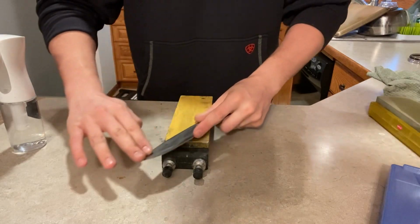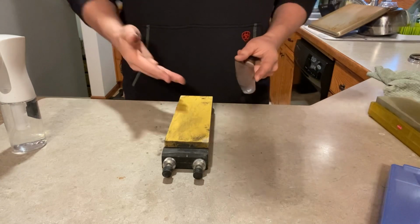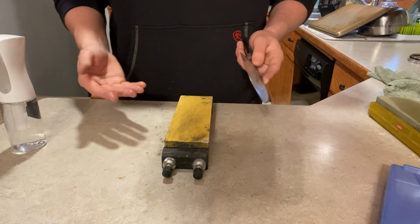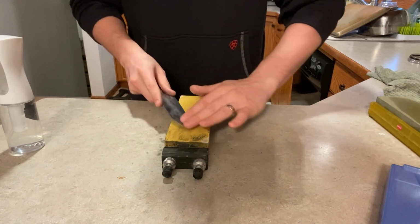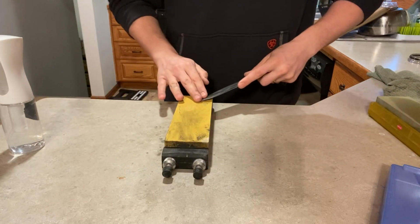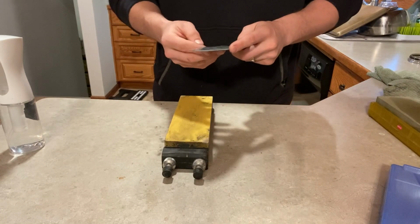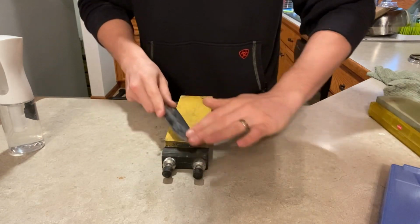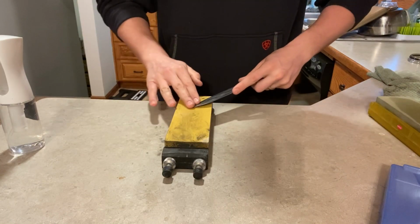I'm just checking to make sure that I've done what I think I've done. Like, don't sit and do 20 stropping strokes and not check if you've actually flipped the burr to the other side, because you just did 20 strokes for no reason at all. So I highly recommend checking your work as you go, because you don't just do stropping strokes or whatever stroke for show. There's a reason you're doing it, so make sure you're actually accomplishing the goal.